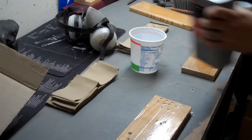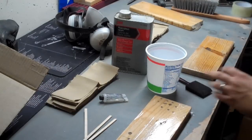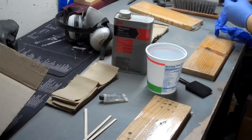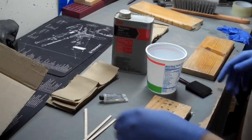Once all the fabric is cut we start gathering stuff to do the fiberglass resin stage. I've got a couple of clamping blocks — these are just pieces of wood with cellophane packing tape on them. The slick side of the packing tape will not stick to the fiberglass resin, which is very nice and makes these clamps easy to use.